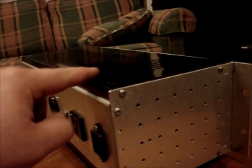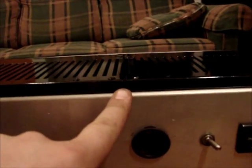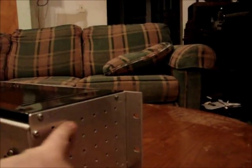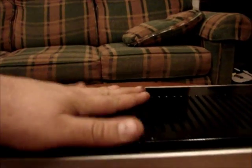It didn't have a top and bottom. So I actually made these from a larger panel that came off a telephone switch that I got from work. I liked it because it had these louvers in it, but it was way too wide — probably about three feet wide. So I cut it to the right depth. This was a 20 inch deep rack mount chassis and I didn't want it that deep. I made the top and the bottom out of covers for an old phone switch, and I pop riveted a small angle here and a wider angle here just to give it support.